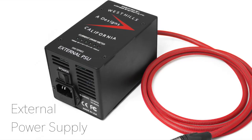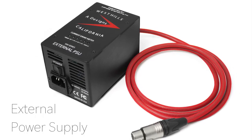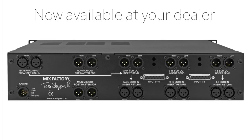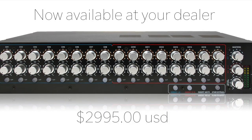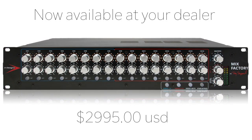That's the Mix Factory in total. It's 16 channels of summing, linkable, with visual references via signal indicator lights. You've got mutes on all 16 channels, inserts on groups one through eight and nine through sixteen, and an insert on the two-bus. Each group has its own submaster and then the overall volume. Take a listen — I think you'll love it. It's really been one of those treats; it's changed the way I've mixed over the last couple of years and I think it'll do a lot for you as well.